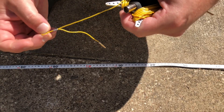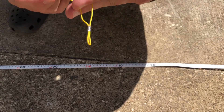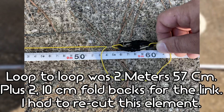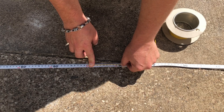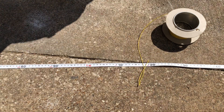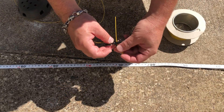We're going to cut them all, we're going to link them all, we're going to analyze them all, and then we're going to do the final finishing — put on the banana plugs and the crimps and all that stuff. Our next link of wire is going to be two meters 53 centimeters. That's including the length of the wire that we need for, hopefully at the end of the day, a 10 centimeter foldback. So I'm going to make that 10 centimeter foldback now. And then we'll go ahead and put that in the carabiner like we did for the 17 meter.